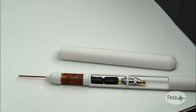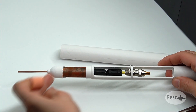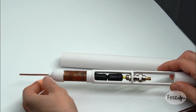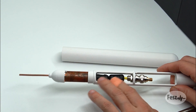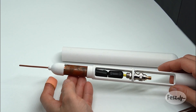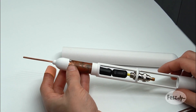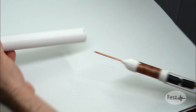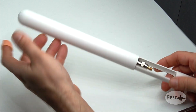To actually build it, I printed some 3D supports from ASA plastic — they should have low dielectric loss, and while it is a bit flimsy, it works. On the bottom I added a bunch of clip-on ferrites: two visible ones and a third one inside of the tube. One idea with this build was that you can also slide a cap over it, so it can be made weather and pigeon proof. This is what the whole thing looks like, fully assembled.